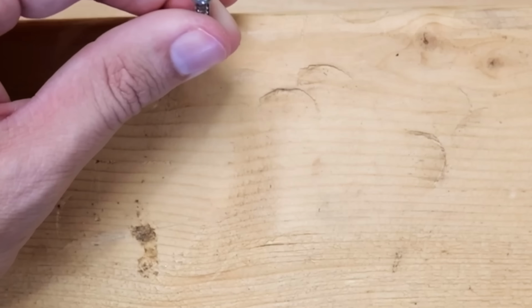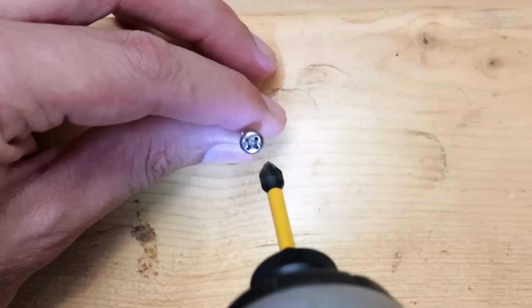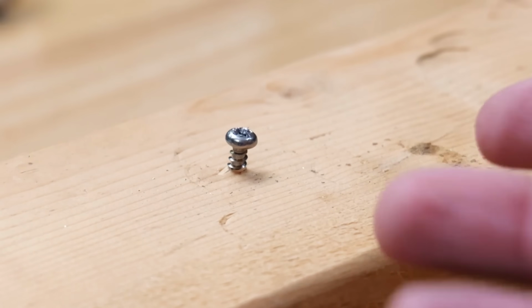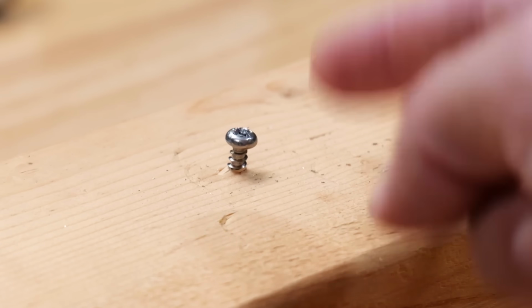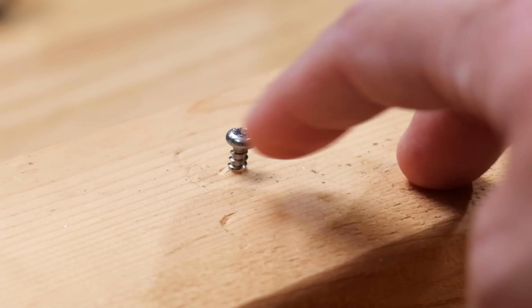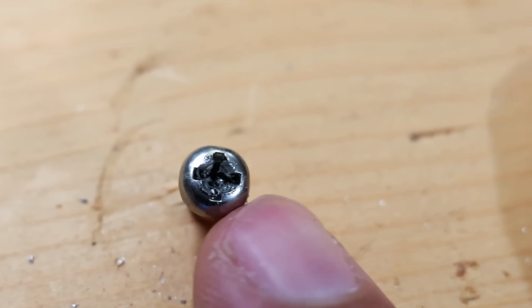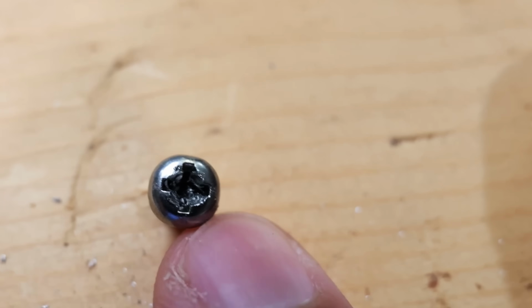You've got your screw, you're ready to put it into whatever it is you're mounting to. You take your screw gun or your impact, and then you go to tighten it down. I'm sure many of you recognize that noise it was making. That is the noise of when there was more resistance on that screw, and the driver bit was actually rounding out those crosses in the top. So as you can see, as we get in really close, that cross recess is now rounded out pretty badly.